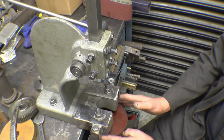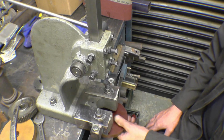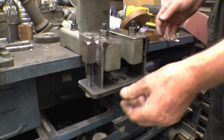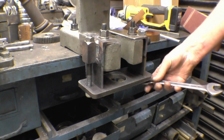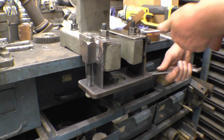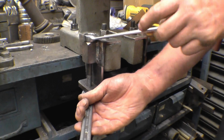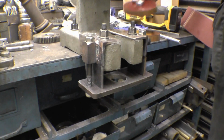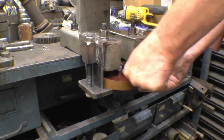You put two spacers in there, parallels, tighten all this up so it's all nice and firm. Next up now, we're hitting the bench. Right, I've drilled two more holes in the bench, moved it forward an inch, and I've put a couple of parallels in underneath there, just so that's going to be held nice and true and square to the actual ram of the press. And they're tightened up, which means all of this now is nice and rigid and basically part of that. So now I've got enough room to get my blank in with the guide.